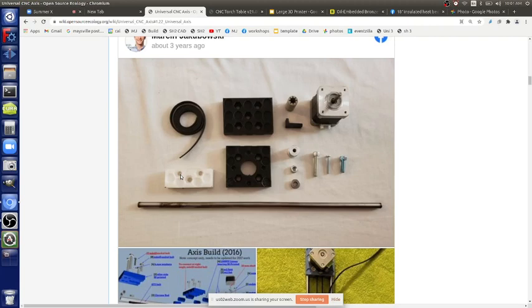We're using one-inch rod. We also got hollow rod from McMaster-Carr — one-inch OD with 1/8-inch wall — which we can use for X and Y to keep those lighter. For Z-axis, hollow rods only come up to six feet and the Z rods are getting very heavy — talking about nine feet and over 100 pounds just for the rod. The constraint on 3D printed parts is whether they're strong enough to hold the weight.